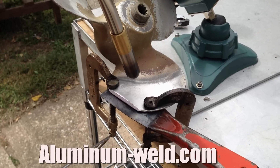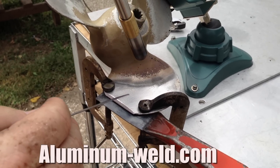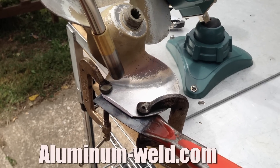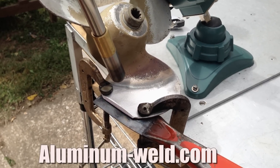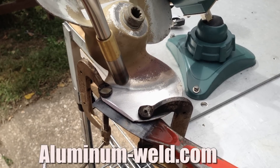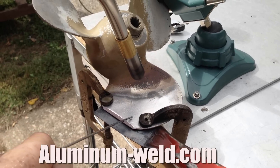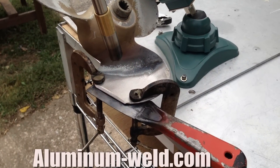It's very simple to do this process — just heat, move the heat away a little bit and check, just like striking a match. Every single time we use the rod, we just make sure we keep the rod out of the flame, ensuring that the aluminum is heated properly. We've been heating this for about three minutes.